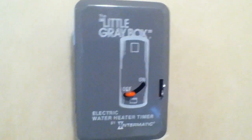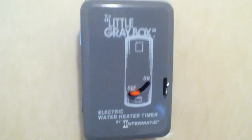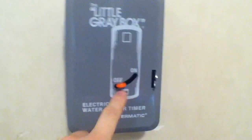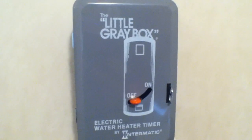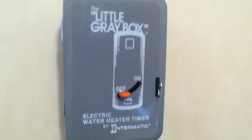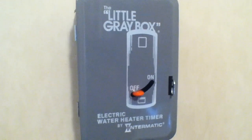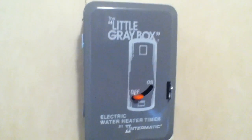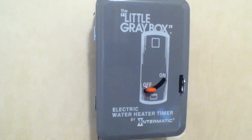Secondly, cost effective — cost effective later down the road as far as your battery bank goes. What I mean is taxing the watts out of it. If you have an off-grid inverter, let's say you have a 20-amp fuse on your water heater and a single water heater element installed. If you put a low-wattage element in it — reducing it down to a 1500-watt or 3500-watt element — you can run that off something as simple as a Magnum 4024 PAE inverter or a 48-volt one. There are so many options on a very affordable budget as far as inverters go. With it on a timer, you use only a couple hours a day worth of power off your battery bank instead of heating that thing all the time. So it's actually critical once you move your water heater off-grid, because at that point you're not wasting energy.